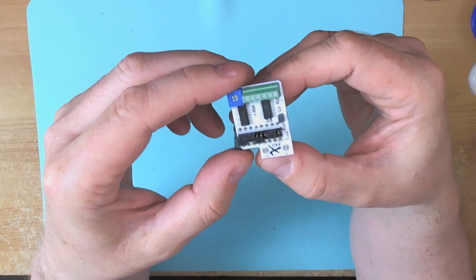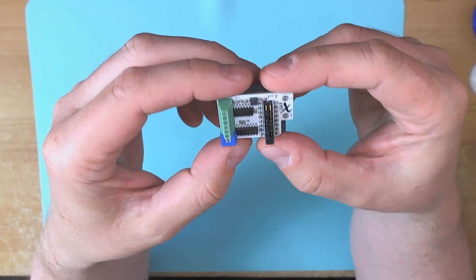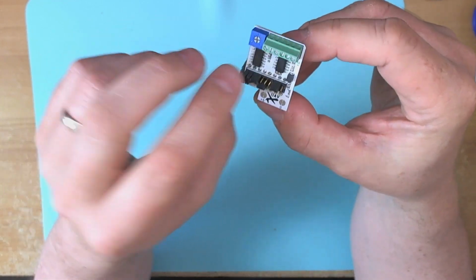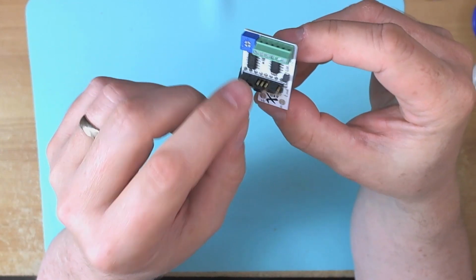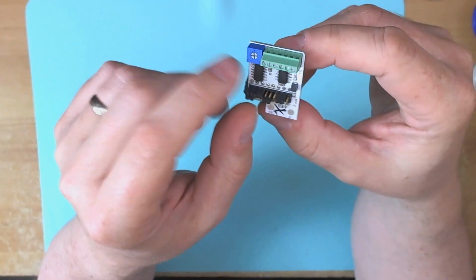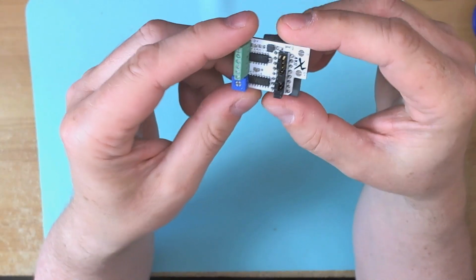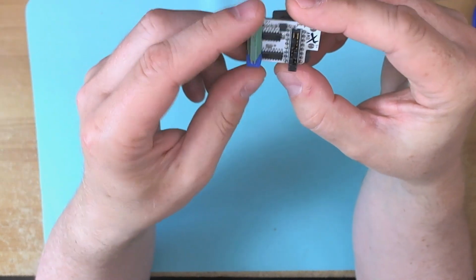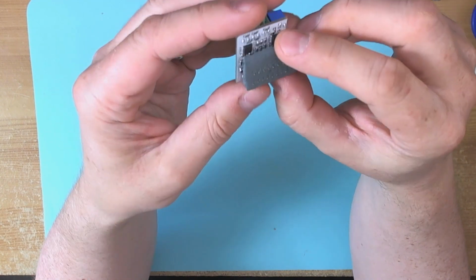So this is the UAV, which was designed by Brian with a Y at the Atari Age Forum. And this board plugs into the CD4050 socket on the Atari. These jumpers need to be configured depending on how the given Atari model uses the gates on the CD4050 chip. They're all different. And the new signals, which are generated right on the board from the input from the GTIA chip, come out of here, and so you can take them to the existing video jack on the motherboard after disconnecting it from the video circuit, and it works beautifully well.